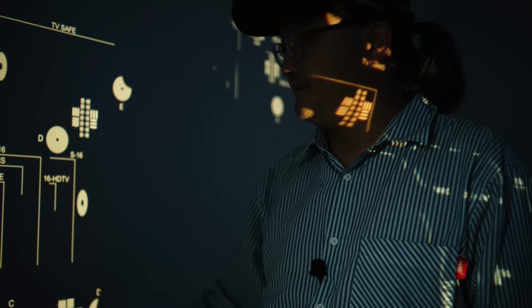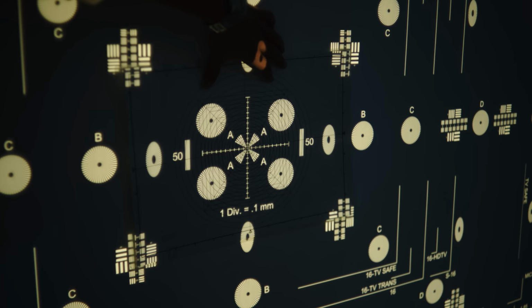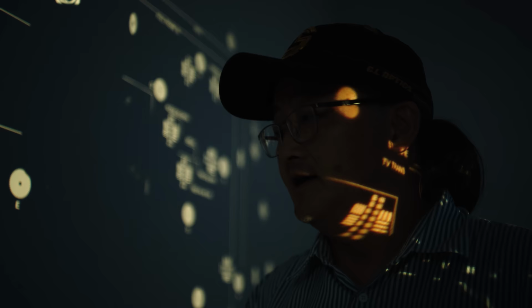As you can see, the image of your 24mm aspherical jumps a little during focus. This means that the elements are not perfectly centered on the optical axis, something common with vintage lenses designed for photography. We are going to fix that with our rehousing.